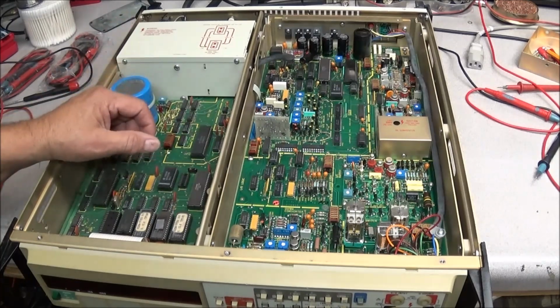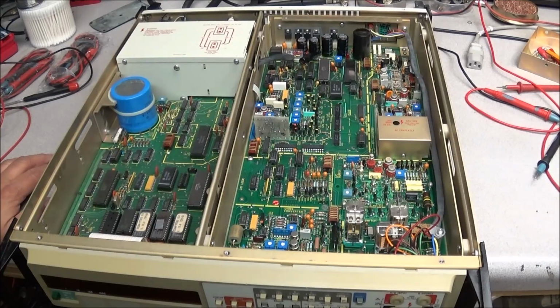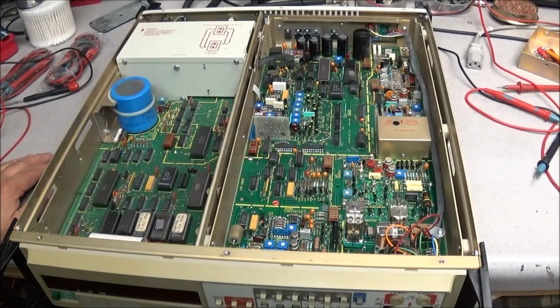This might make a little setback in getting the thing going, because it's going to cost a bit. Some of those tantalum capacitors are a couple of bucks each, depending on where you get them from. I'm seeing about 20-25 cents difference. Now, I'm not going to order 1,000 6.8s. I probably haven't replaced two dozen tantalum capacitors in the last 12 months, so there's no way I'm going to order that many just to get the price down for a bunch of jelly bean parts.